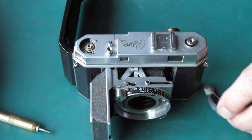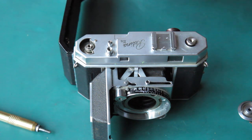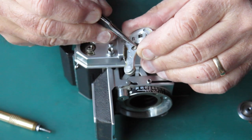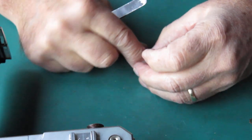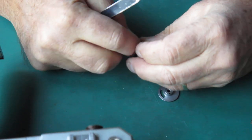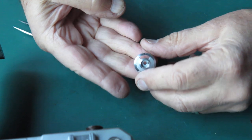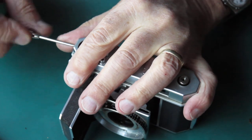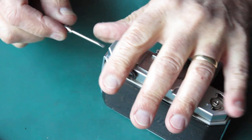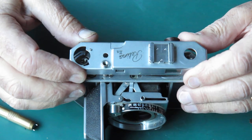Though it did tighten down okay, not a good sign. The film advance lever — the end-of-film latch is there and working correctly, that's always a good sign. Let's take this lot apart. These pieces need to go in the cleaner. This piece has to be cleaned by hand because of the painted marks, likewise the number disc. Now the top cover off. I'm separating these pieces out to those that will be cleaned in the ultrasonic cleaner and those that will be cleaned manually.